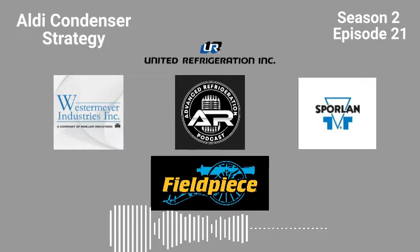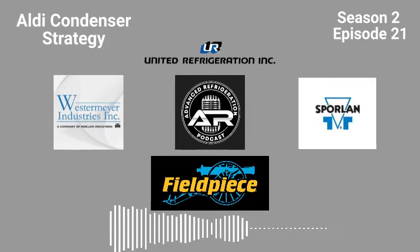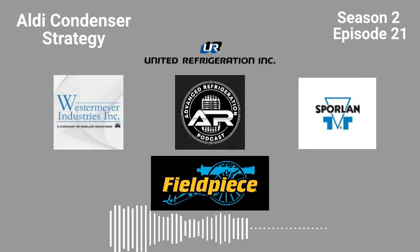The VFD bypass output is controlled from a digital sensor control. This is where guys get messed up a lot. Relay 8 must have its dip switch in the down position — I see technicians flip it up all the time thinking it should be up based on how it's wired, but it needs to be down. The system monitors the summer condenser PID and outside air temp.